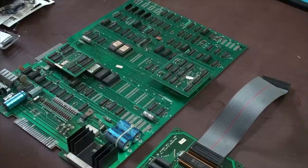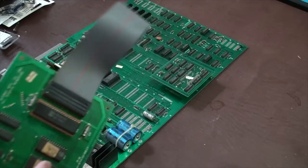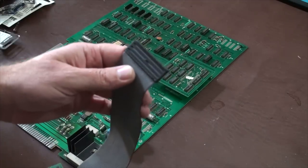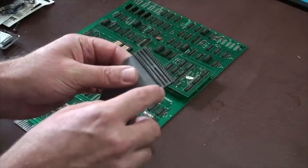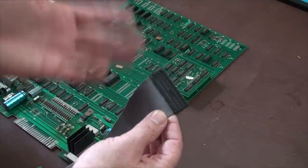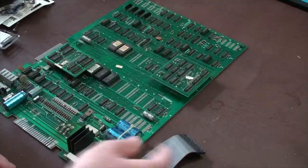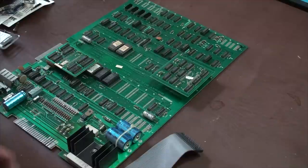And the very first thing that you want to do, we'll use this as an example right here. This one, the ribbon cable, because as time goes by, these guys get old and brittle. And some of these pins actually ended up just breaking off, coming loose. So I had to order a new ribbon cable. This is causing, I guarantee, the majority of the problem right here. And that's on its way, okay? But this would be considered a loose connection. You know, $5 fix, not a big deal.